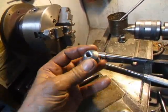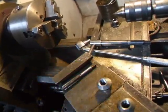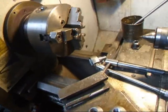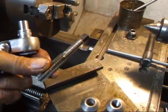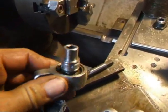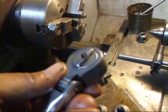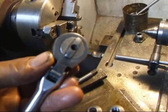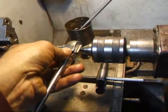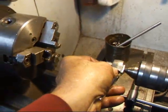I made up these little pieces here to slide into a piece of tubing and I got some holes drilled. This one is actually finished off but I need to tap this hole. I want to show you how I do it here on the lathe. It's pretty simple — this is my tap, it's a half inch 20 right hand thread, and this is a socket from Snap-on. This ratchet is one that I modified — I took and put a hole in the back of it and cut a 60-degree taper in it so that I could put it on my lathe and follow it with the handle and tap my piece. I'm going to show you how that's done.